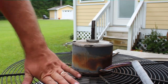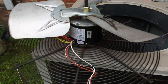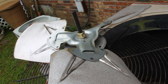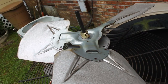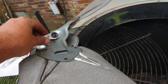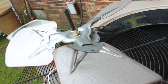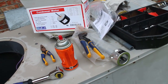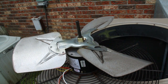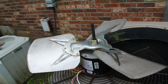We'll take the motor loose from the grate on top and replace it with a new motor. I have my new motor in there — you can see it mounted, the blade's mounted. Even though I got the blade off with groove joint pliers, I really don't suggest putting it back on with those because you won't be able to tighten it enough. I was able to tighten it using the larger opening in my service wrench, slipping that down over it and getting the smaller opening to fit across. Now I'm about to get things wired back up. We'll split it into two capacitors — one for the compressor and one for the fan — since this motor requires 10 microfarads.